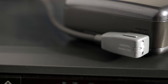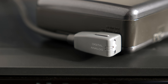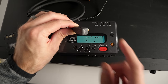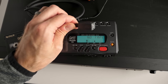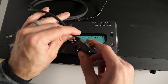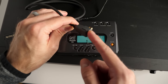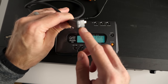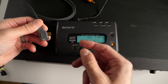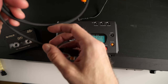What's also interesting is on the end of the connector there's a switch between digital and analog. All that does when switched to analog is basically turn this cable off. The recorder detects the presence of the cable by seeing two pins shorted together on the connector, so sliding the switch to analog unshorts those pins so the recorder doesn't think the cable is attached anymore.